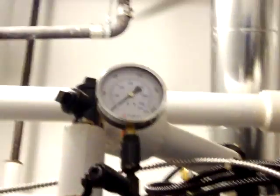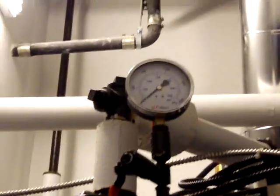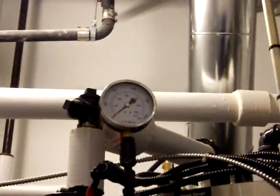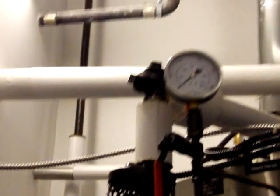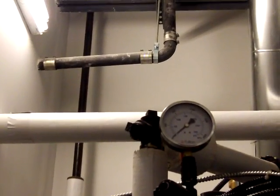For what it's worth, this should only be done at 10 to 15 pounds pressure on the boiler. If you miss it or it's late in the day, it's best simply to do it the next day. If you have any questions, by all means give us a call at 800-941-6673.